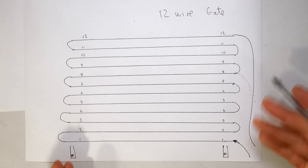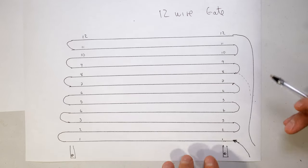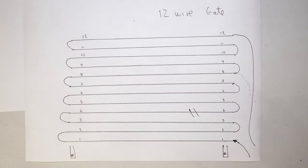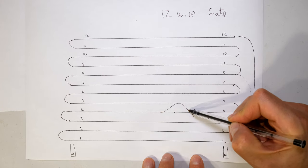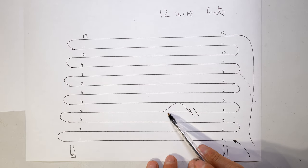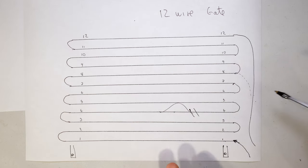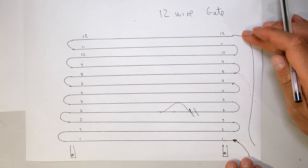While it might look like they're in parallel, they're not - this is a series circuit. If somebody had to come and cut any one of these wires, your electric fence alarm will activate. However, if somebody pushes line 4 onto line 5, the alarm will not activate, because you're touching live on live and the potential difference is too similar. If you want to add earth wires in between, you can, but I'm not going to explain that now.